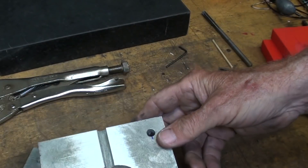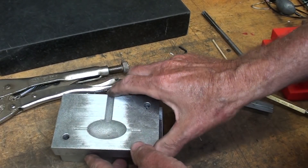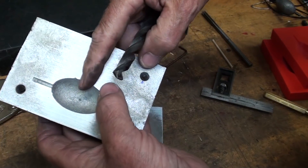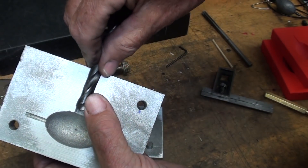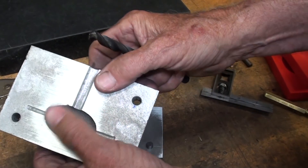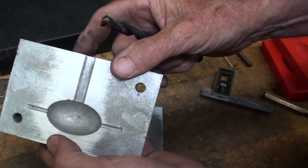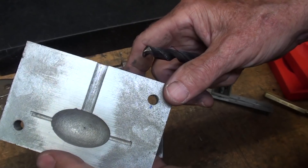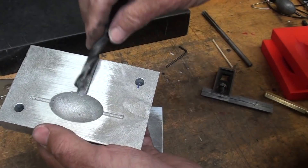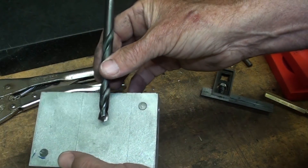Alright, it's starting to shape up. The next thing I will do is go over to the milling machine — though it could be done in the drill press too — and re-drill these holes. What size? I have decided: three-eighths, and I'm not going to go all the way into the egg, just about this deep. I want the metal to flow in fast. I don't care if it necks down a little bit, because then when I saw it off, there's less to saw and file. It doesn't have to be smooth — it just doesn't matter on a weight. I decided to use the drill press.